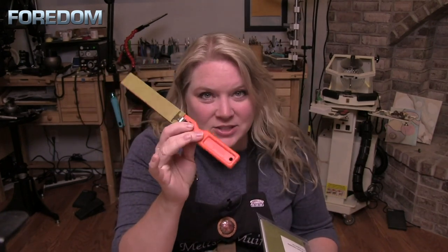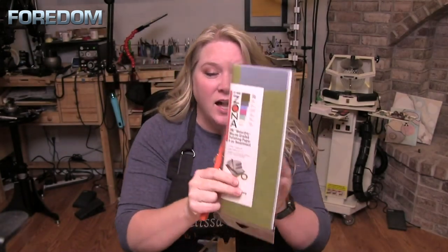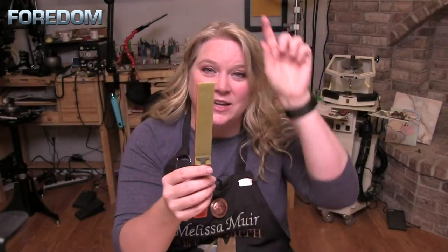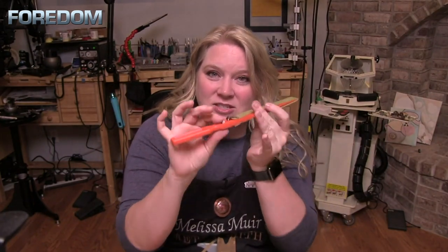As you can see, it's quite easy to do. I know several of you are going to ask where to find those polishing papers — I use an adjustable sanding stick holder and these sanding papers from Zona. The nice thing about these is that you just cut a strip, fold it in half, and tighten it onto the holder. They come in two different sizes, so make sure you check those out — I'll include links down below. Find a file that's not going to contaminate your other metals, file away, and it may take a little time because you are shaping metal. Have a good day and we'll see you next time.